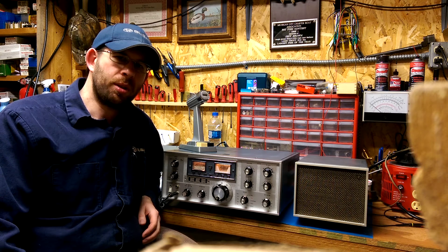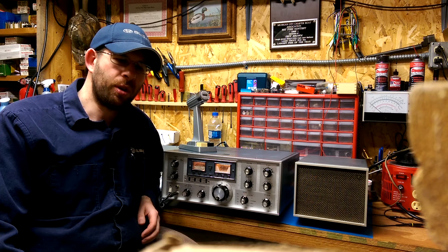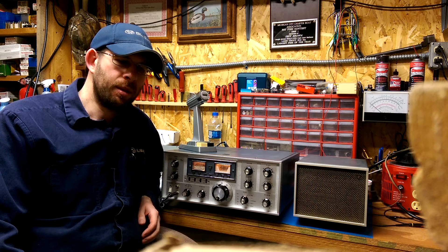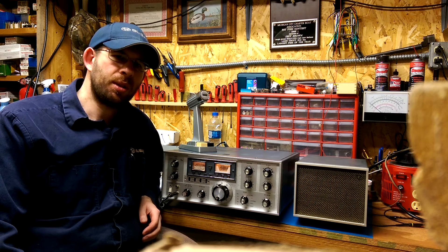There was a question earlier about whether it would transmit on 10 meters at all. It does transmit on 10 meters but at a very, very low level so far from what I can tell. 40, 80, 20, and 15 all seem to be fine. It could have any number of issues — from bias level, or tube-related, since it uses about 20-some tubes. So it's entirely possible that that might be part of the problem.